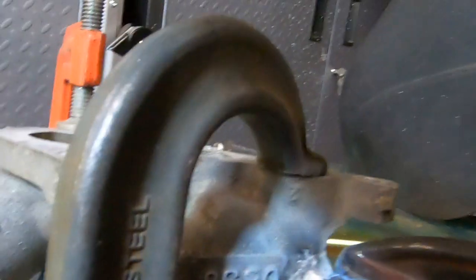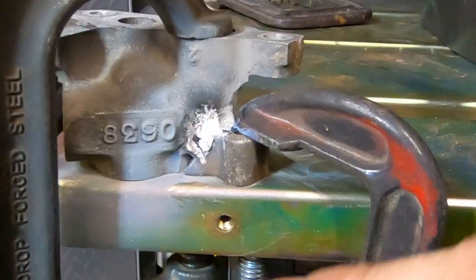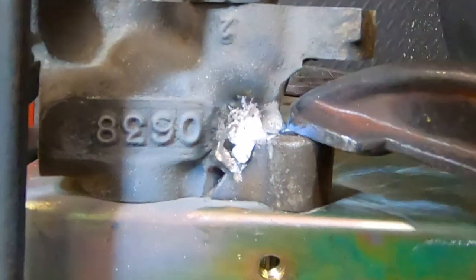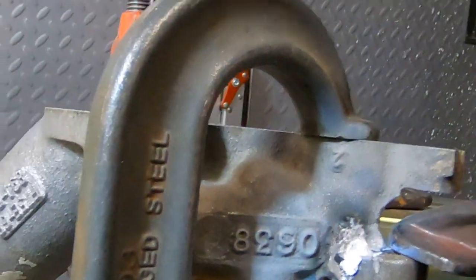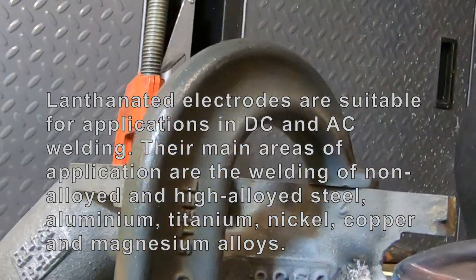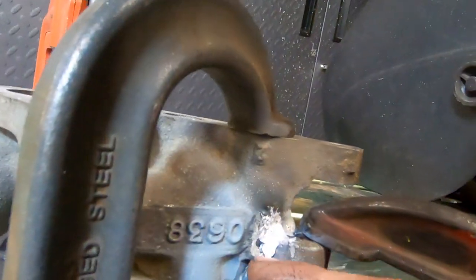And normally you'd have a more blunted tip, a tip that would just kind of be like this, and I've got it more like this, and that was intentional. I can't remember which tungsten I'm using. It's the blue tungsten. I can't remember if that's 2% or 5%. But it works well for this. It's more of a general use tungsten. So anyway, I'm gonna let this cool.